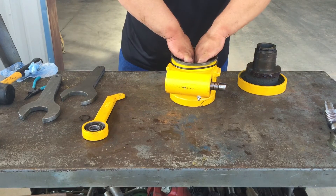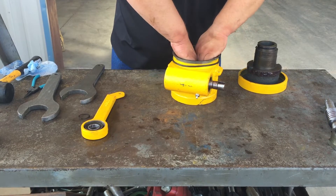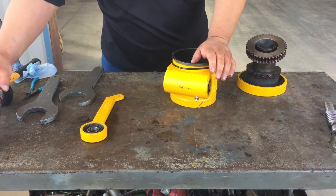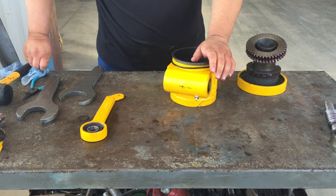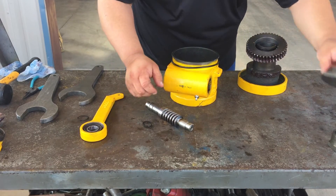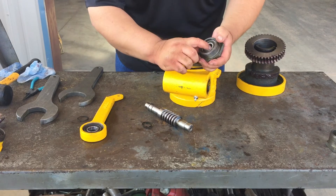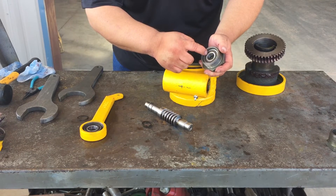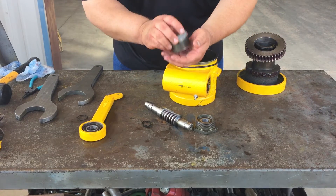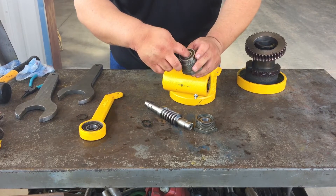We need to pull out our worm gear and then our worm drive. Now you'll be getting a kit. In your kit you'll get a new worm drive, two new snap rings, and a backstop nut with a one-way bearing — I've already installed this one-way bearing. It has to go in a certain direction for it to work. On your backstop nut there's an arrow and you'll be able to see it. Here's your actuator body — it will also have a one-way bearing. On this one, though, you will not see the arrow. It is back against the actuator body when it's installed.